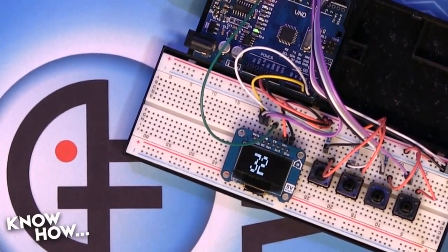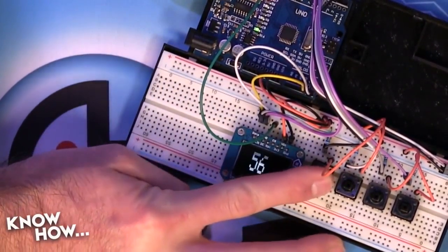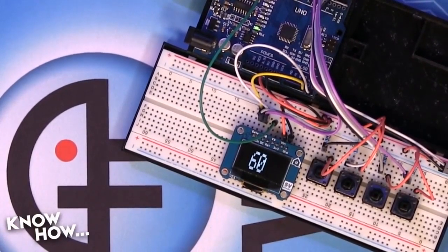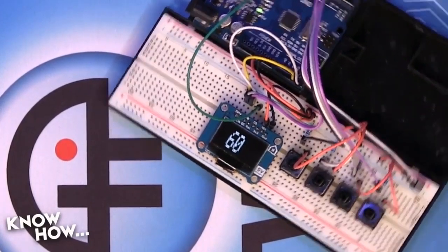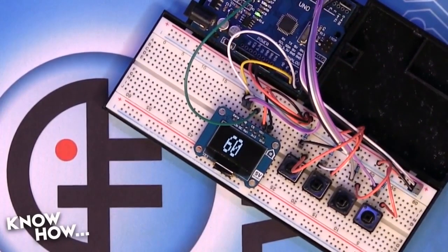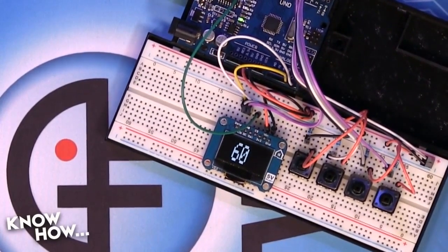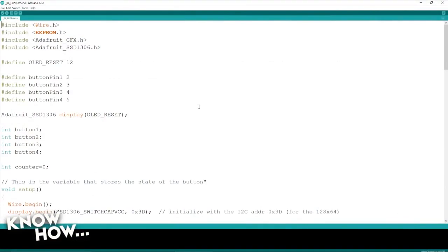Or, you know, even worse, what if I'm using this to count how much nutrients to add to the water, and it keeps having a bug where it keeps browning out, and it just keeps resetting to zero before it gets to the stop. You speak like a man who's gone through that before. This is not hypothetical. This actually did happen. What we need is a way to make sure that that value, whatever that counter is, is persistent. It stays after power off. Okay. And that's what we're going to use the EEPROM for. So if you go back to my screen, Carol, we have a wonderful little example here for the EEPROM.